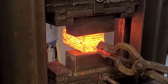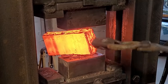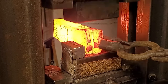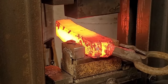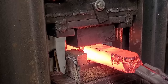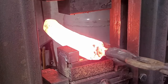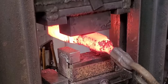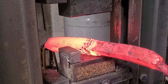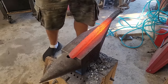This will be my final forge weld on this part of the build. I'm gonna slowly draw it out to get to about one inch by one inch so I can twist my layers. I'm going for a Turkish twist look pattern where it has the little X going through it — I think it's really cool, and I want that to be the centerpiece of my blade, so I'm gonna make two and twist them: one clockwise, one counterclockwise, to get that distinctive pattern. Here I'm using one-inch kiss blocks to get it the right size, alternating back and forth between sides.